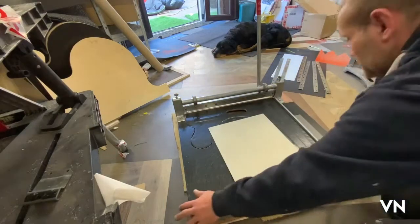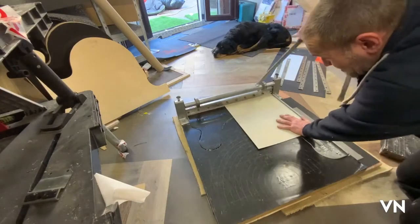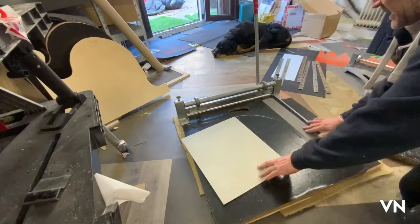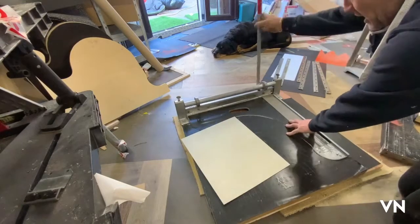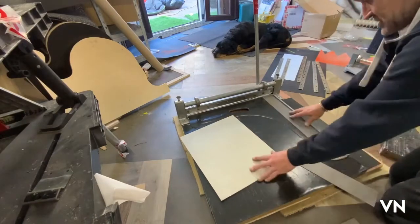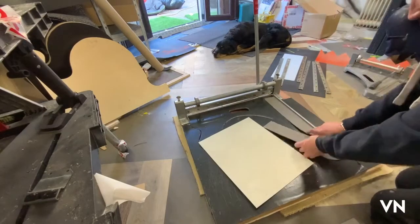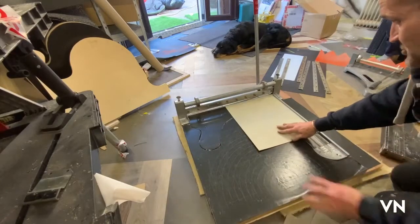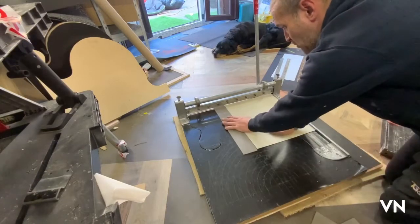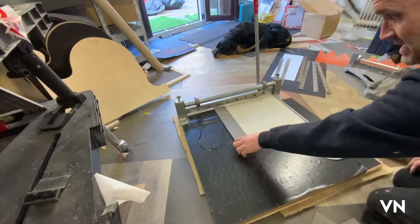The shear on it is what makes it with these machines. What I was thinking is we could show other tips — like if you're doing a lot of cutting down to 3 inches or whatever, you can put other bits in the side to utilise other parts of the blade across there. Otherwise you'd just be wearing out one part of the blade. You can use anything to get it in there square, and just think like that if you're doing multiple cuts for one of the patterns — don't constantly just smash it out one end.